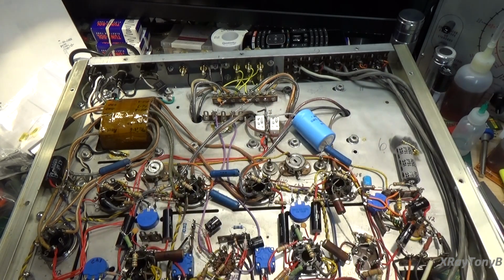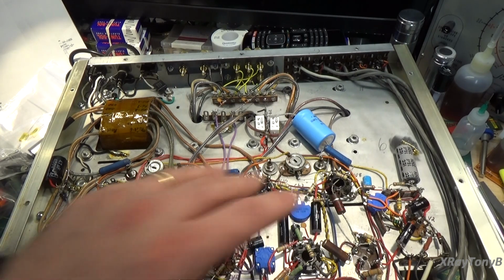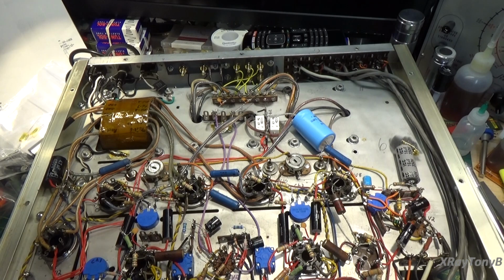First of all, make sure all the wiring is good. Make sure it powers up. And then see if we can get the tubes to bias properly and to balance, and see if we can get some sound pushed through here. So once I get those things set up, I will be back.